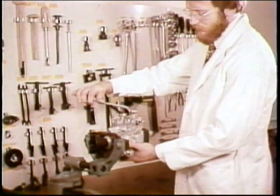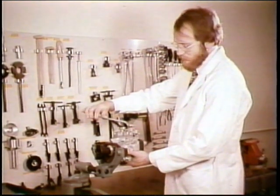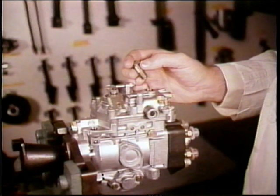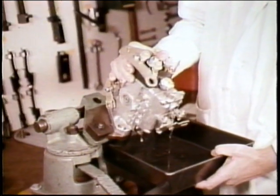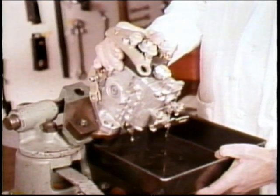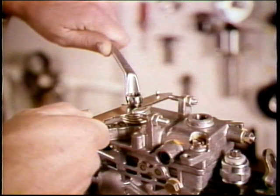With the pump mounted in the proper flange adapter and clamp, you begin by removing the overflow fitting. Place it on a clean shop rag. Now tip the pump over to drain the fuel from the pump. You'll recall that the pump is normally full of fuel.